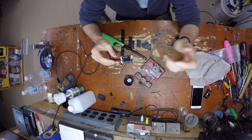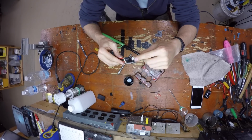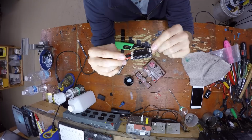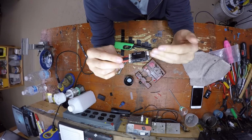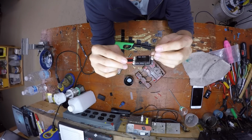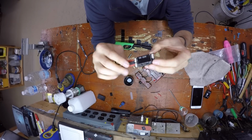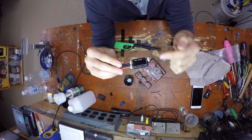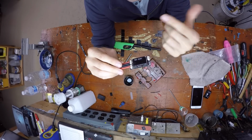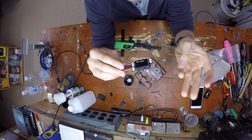Now, the connectors, obviously, you got to figure out which one is camera and VTX. I know for a fact that the 4-pin on this side next to this microphone right here is your VTX wire. Just make sure that you have your pins pinned out correctly. So what I usually do is go to Google Images, type in PNP50, and if you scroll down to, like, I don't know, maybe the 6th or 7th image, there's actually a picture of one sitting in this exact orientation, and it has the pins coming in with red, yellow, black, orange, or red, yellow, black, and white, which red is positive, obviously, negative is black, yellow is video, and white is audio.